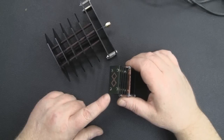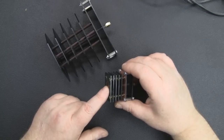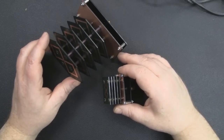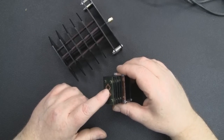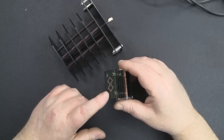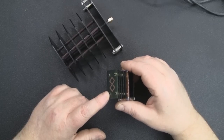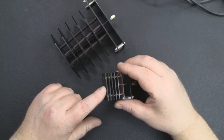So the next part of the video is step by step how I constructed this 5.8 gigahertz biquad Yagi. Because I had to go back and redesign the elements, I decided to film it this time, and the methods that I used to construct this are exactly the same as for the 2.4 gigahertz one. But by no means is this a step-by-step on how to etch circuit board. I do show you some of the methods that I use, but if you have never etched circuit board before and you want to attempt to make one of these antennas, then I suggest you do a lot more reading first, and then come back, download the PDF files that I've included in the description, and you can have a go at making your own. And in initial tests, these are really powerful antennas.